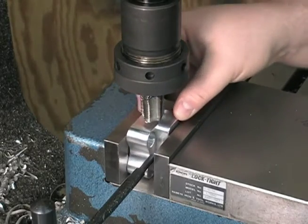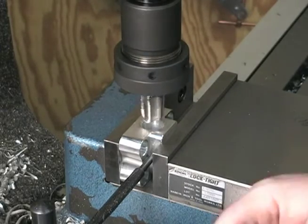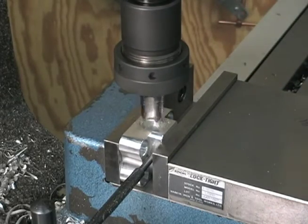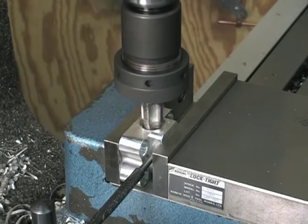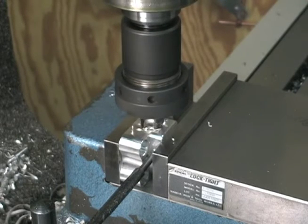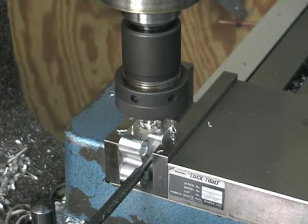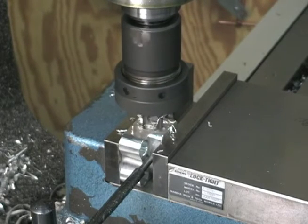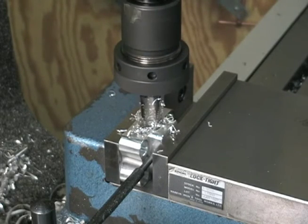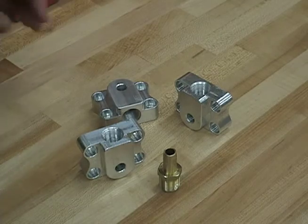It's a short video. Got the machine running in back here at about 60 RPM. I just get it down there, let it get started, and then it feeds itself. I've got a depth stop set on the quill so I know when to flip the drum switch in reverse direction.